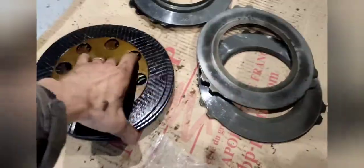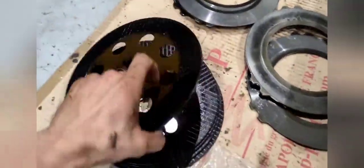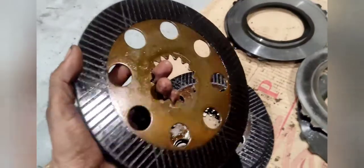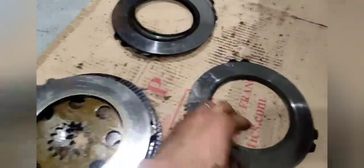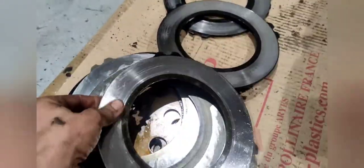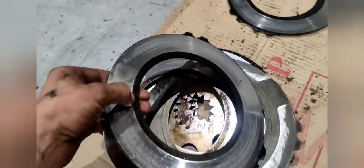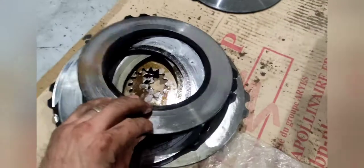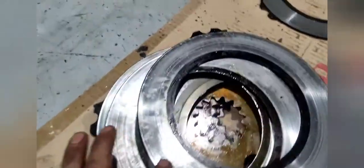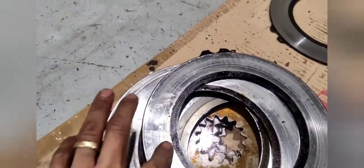Here are the old parts. You have five brake discs — these brake discs are not that worn but they're kind of damaged from the bad oil. And these metal plates — you can see wear marks and under your fingernail you can clearly see they're a bit worn. So I decided just to put everything brand new. This one is bad, you can feel this one.